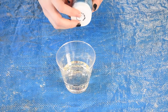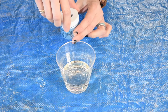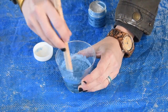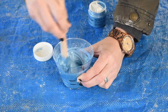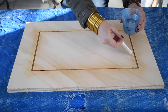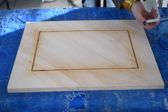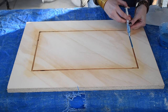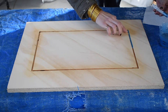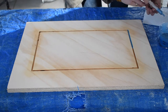This powder I got online is a natural mineral cosmetic mica. I looked up inlay and I have no idea how much to add — I didn't need a lot before, so I'll mix it in carefully. I'm going to use this syringe that I got for free at the drugstore and I'm hoping that'll help me control the epoxy. The syringe makes it so much easier. I think I need to put in a little bit more because right now it's below the edge of my router groove, so I'm going to keep on going.